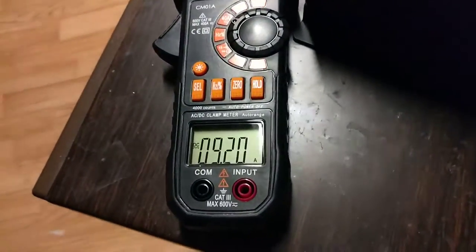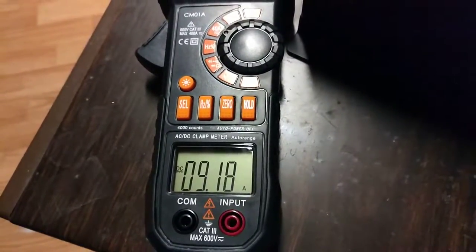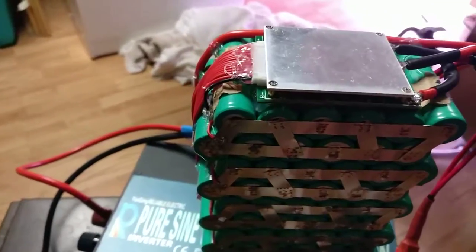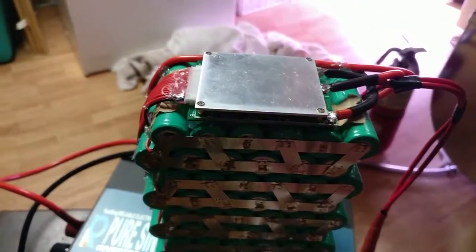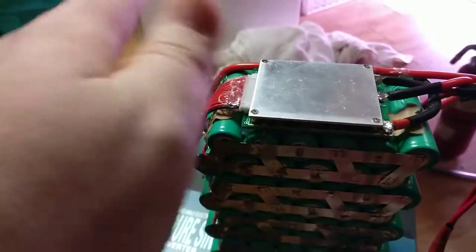From the 48 volt or 54.6 volt battery, it's pulling a steady 9 amps right now, and that is about the most that I'm comfortable with. Each cell should be able to handle 4 amps sustained, but I want to keep it under 2 amps. Right now it's about 1.5 amps per cell. They're not getting warm at all, which is good.